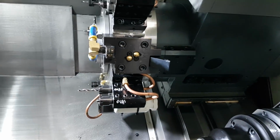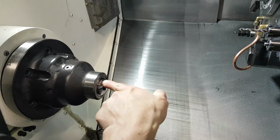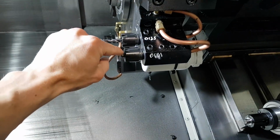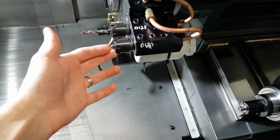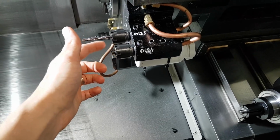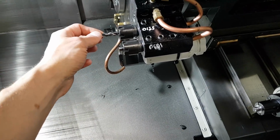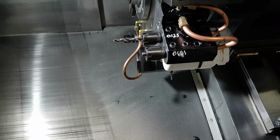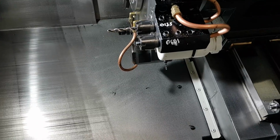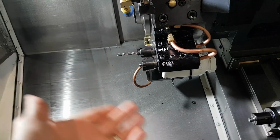So I think what happened was, one of my theories was that the alignment of that was not perfectly in line with the spindle center line, and you have to put a dial test indicator on here and indicate them in. I did yesterday after breaking all the tools, and it was several thousandths of an inch out, I think up to 9 thousandths in Y for one of the tools. So that's probably the reason. I'll spot it, I'll do a pilot hole, I'll do a through coolant drill, exactly by the book, right speeds and feeds and everything, and yeah, just frustrating after making 10 clips and then having the drill break, kind of 2 in a row.